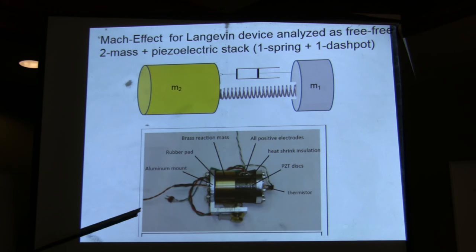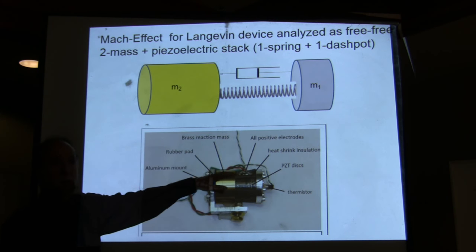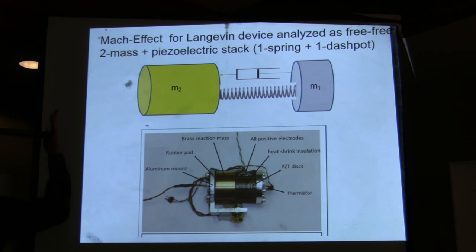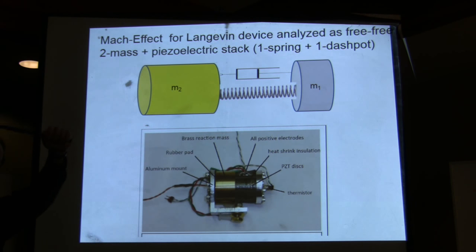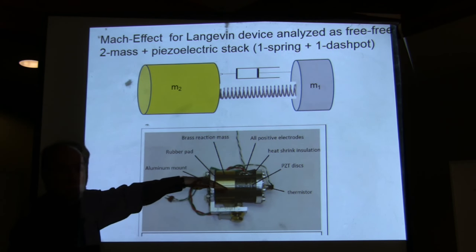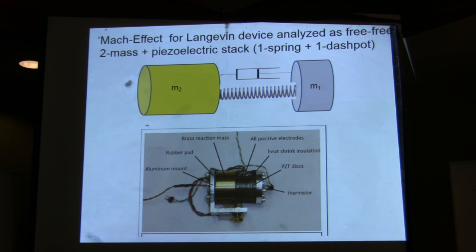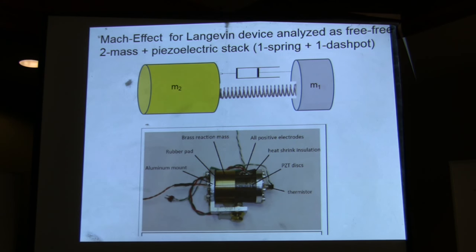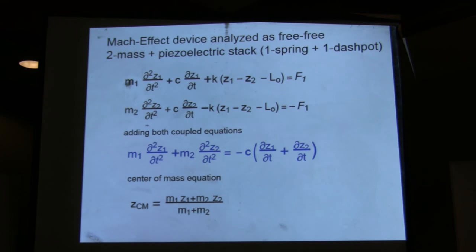I can show you that it is negligible, because the stiffness of anything in uniaxial tension or compression is much, much more than if I wanted to bend this. I can bend it very, very easily because this thing is very thin. So if you analyze this, it's going to be a much lower natural frequency, so it's decoupled, because when you go over a natural frequency, the motion is much smaller. Anyway, we have shown this experimentally as well.